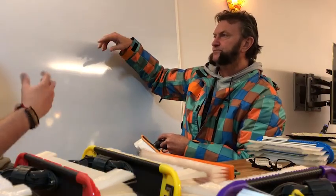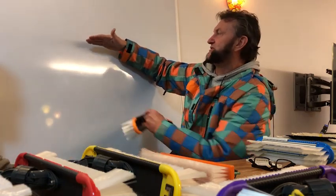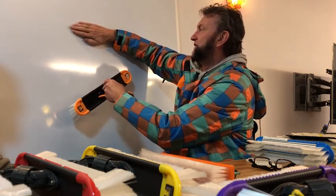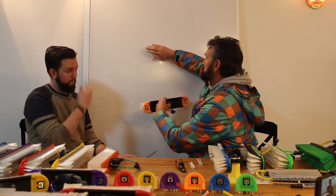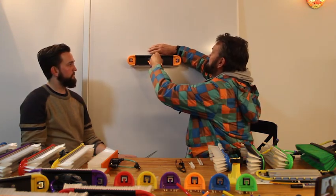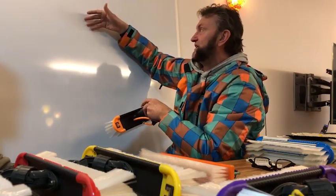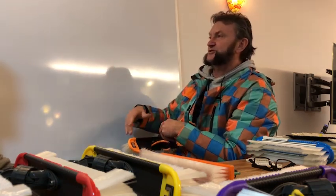Let's give some concrete examples. Window cleaners are listening, so they know what windows look like. If the residential frames are usually flat, commercial frames stick out, and we're mostly talking about residential. If he's agitated to there, and then he rinses like this and the water goes there, then whatever that is has got dirt on it, and it's going to fall into your rinse and leave spots on the glass.